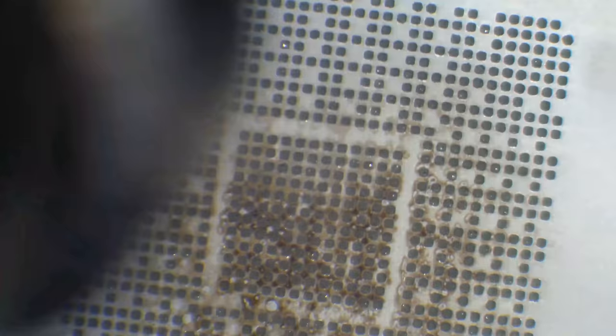And you'll see the flux will start to melt. So there's flux already in the solder paste. Solder paste is basically just millions and millions of tiny, tiny, tiny balls. And then it's mixed with flux, which is why you can see odd little glistens as some of the odd solder balls are starting to melt. I'm just taking it slow. Now I'm going to move in and start focusing on individual areas. I could probably do with increasing temperature a little bit, so I'm going to go an extra 20 degrees. And go to 360. This is lead free solder as well, so it does take a bit more to warm up and to actually melt. Here we go.